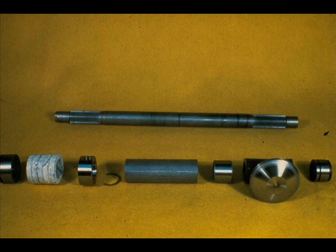This exploded view shows the valve internal parts that fit on the shaft. They are, from left to right: the packing follower, packing, packing box ring, retaining ring, spacer tube, upper guide bushing, plug, and lower guide bushing.